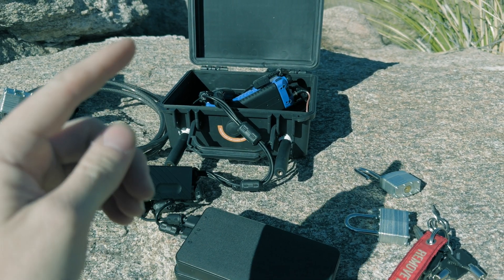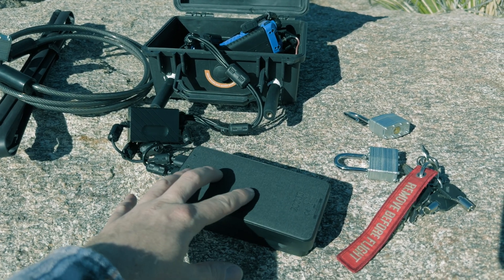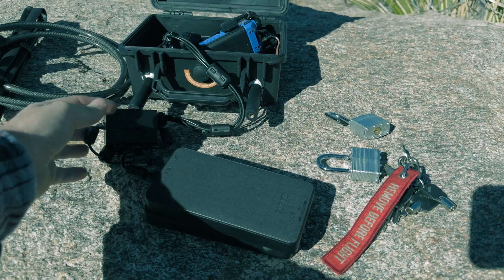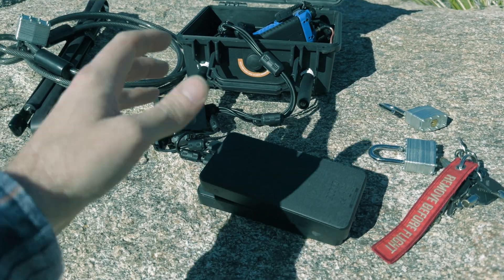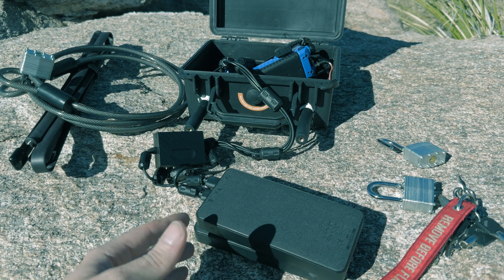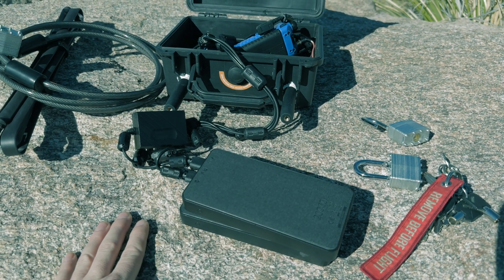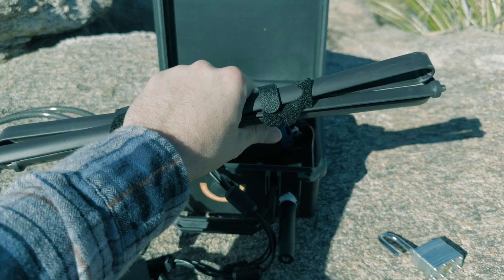The reason you only want the Roger beep on the transmit radio: if you put it on the receive radio, the receive radio picks up a transmission, and when you're done transmitting it does the Roger beep — but that sends a Roger beep through the box and keys it up again. Because the box is bidirectional, it ends up in an infinite loop. It took me a couple of days to troubleshoot that. You do want Roger beep on the transmit side, though, because it acts as a beacon letting you know you've connected to the repeater.